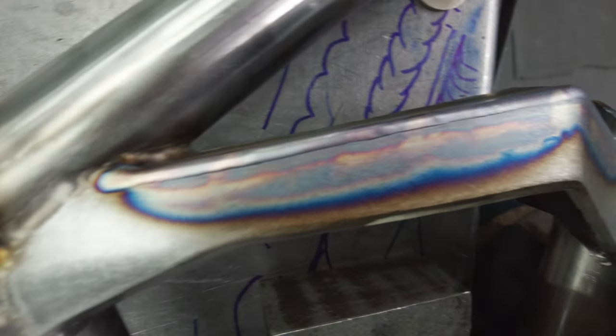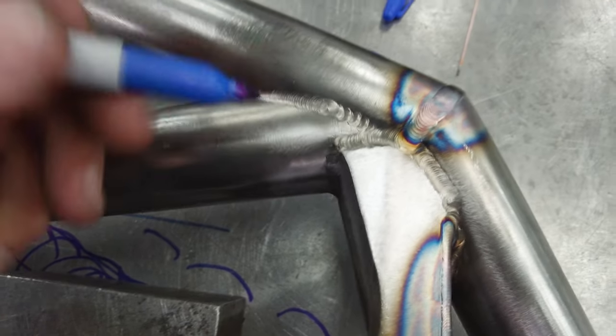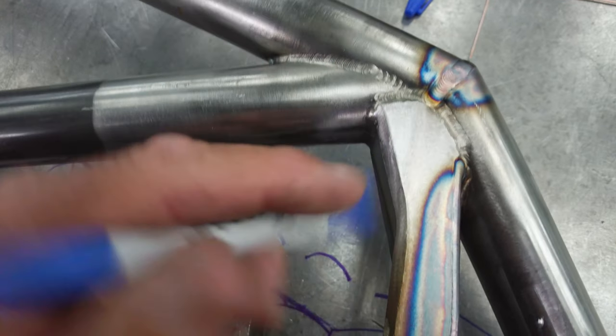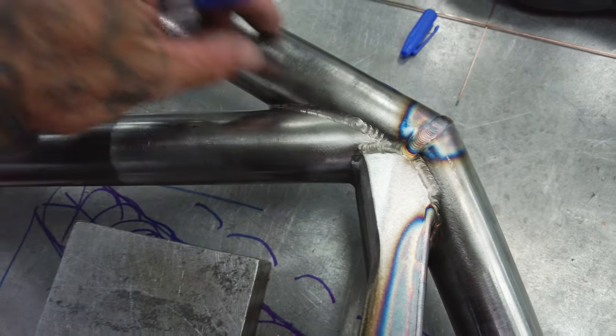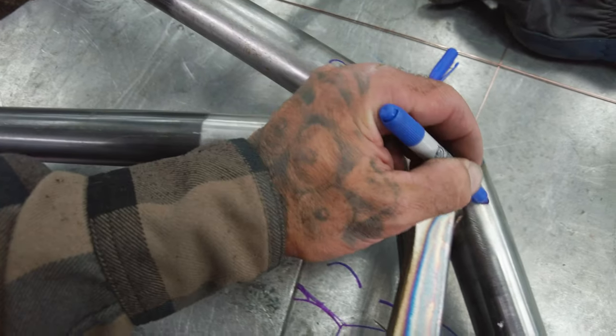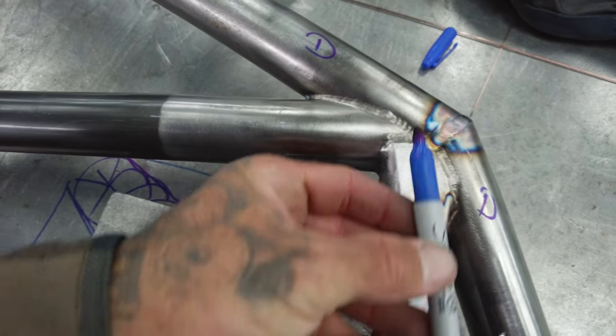Something I've talked about before is that overlap with the welding to display the construction of it. You can see these are the passes we've been working on. Pretty consistent. And obviously that's what we started with, right? Our fully prepped edge. But what I wanted to touch on really quick is this overlap process. Everything's been 360 welded. Before this plate structure went on, we had the miter welded under here because this was our primary tubes, right? Primary structure, secondary structure, tertiary or third structure.